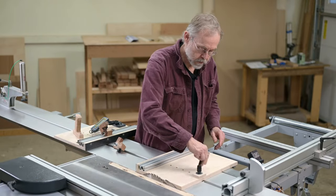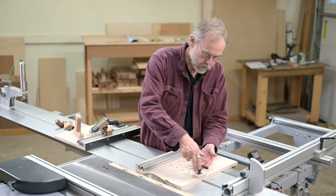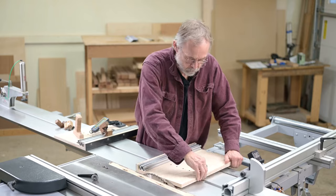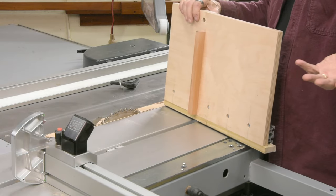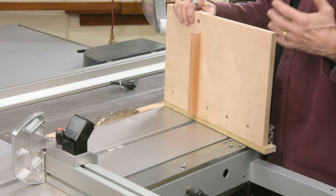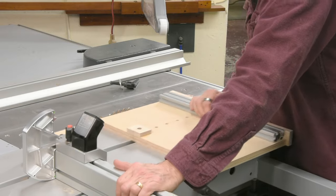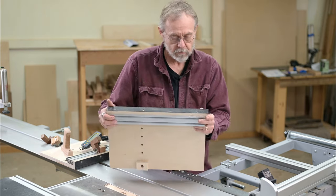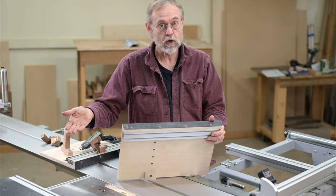The runners for the plates were done much the same way. I have a lock system here. The runners were made oversized a little bit and shaved down gradually until they just barely fit in the groove, then waxed up — and they run nice and smooth. On these fences, I wanted them adjustable. You can see they fit in the T-track and have screws — loosen them up and move them in and out. So I can always adjust for a fresh zero, different blade, or whatever.